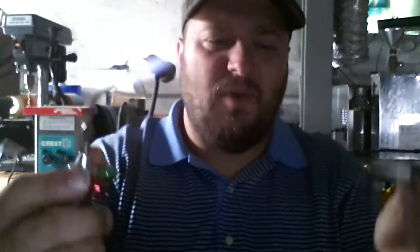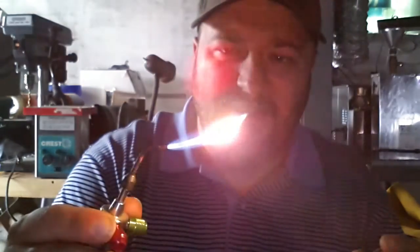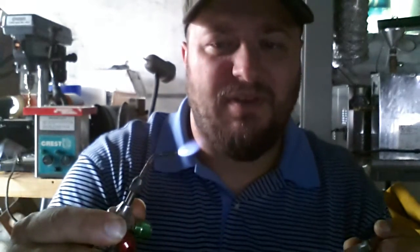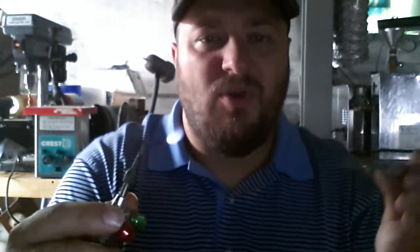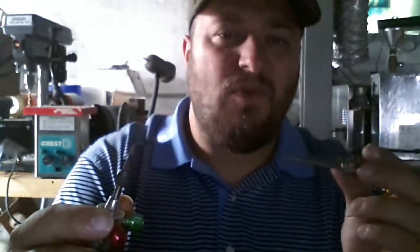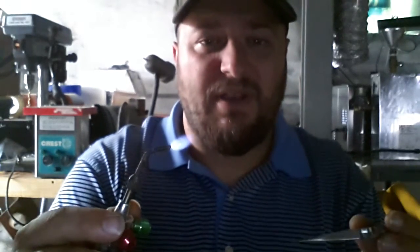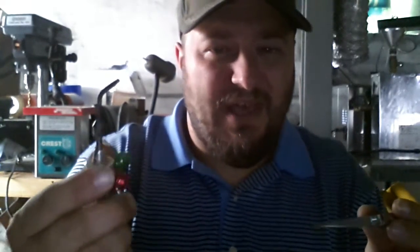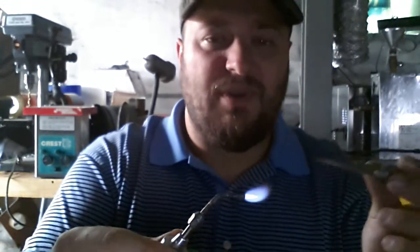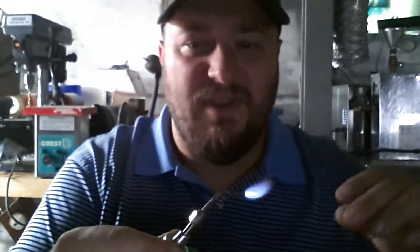That's the other thing: if you're working with something really small, you're going to take a lot of the excess heat out of the equation. You only need about 2,000 degrees to get the job done in most cases. This torch can produce up to 4,400, sometimes even 4,800 degrees Fahrenheit — and that's a lot. So limit your excess heat, and that will in turn limit the amount of times you melt stuff unintentionally.